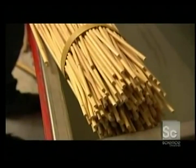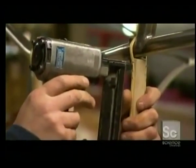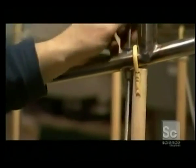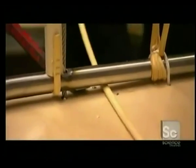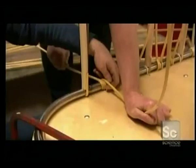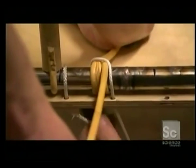The basket walls are made of cane, the stiff stems of a tropical Asian plant. The cane soaks overnight in a water tank. By morning, it's supple and the weavers can begin their craft. They start by installing uprights, attaching each one to the frame at the top and bottom with a thin piece of cane. Then they feed the support cables from the floor up through the frame. The uprights are 18 inches apart along the sides and 4 inches apart around the corners. The weavers fill the gaps with thinner uprights every 2 inches. The uprights are tied to the frame and floor with rope.